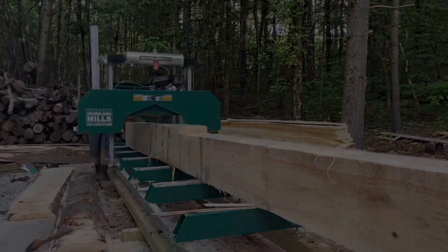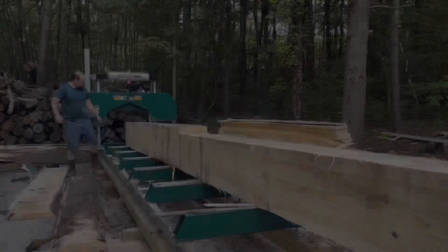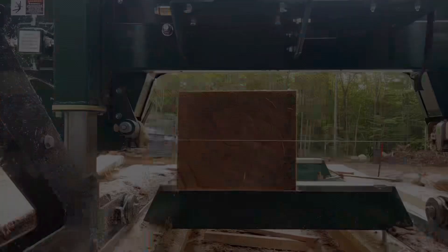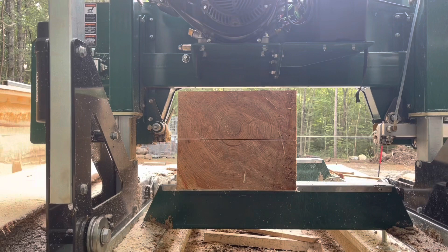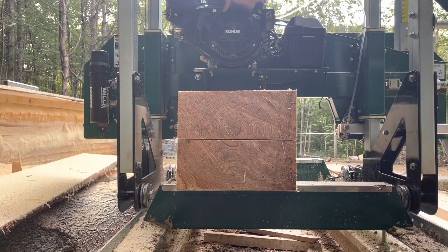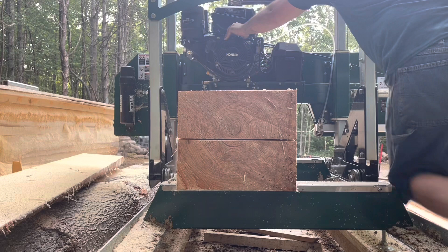The keys are making sure your first cut is the same off the heart end to end, and that all subsequent cuts are parallel and square to that first cut. It's like a house: start with a good foundation and everything follows from it. This is the last cut milling into the two 6-by-14 carrying beams, 24 feet long. With the Y-braces supporting the ends, the actual span is closer to 19 to 20 feet. Seven months later the building's been up five or six months with no sags in the beams — everything's working out. Thanks for watching.